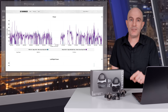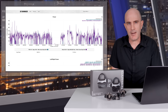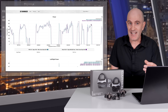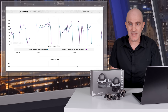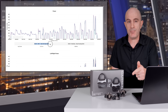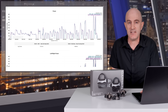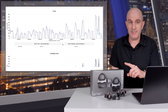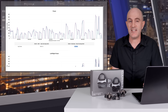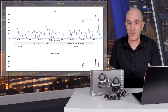Speaking of secure Bluetooth, this leads me to a little issue I've observed. After my first ride using secure Bluetooth with these pedals, I noted the overall power wasn't matching the other power meter on the bike as closely as previous rides when I was using ANT+. Digging into the data, I could see the Rally holding on to the last known reported value when I was coasting — classic sticky watts — and this wasn't happening over ANT+. To confirm what I was seeing, I performed another ride where I was paired to the same Rally power meter with ANT+ on one Edge bike computer and secure Bluetooth on another. Steady state data was fine, as close as can be expected. But when I was coasting — that's a big problem, because it inflates averages, normalized power, and TSS, especially in stop-start riding, which is exactly where the XC pedals are meant to shine. This issue has been reported to Garmin, they've acknowledged it, and they're looking at getting it resolved — so stay tuned on this.